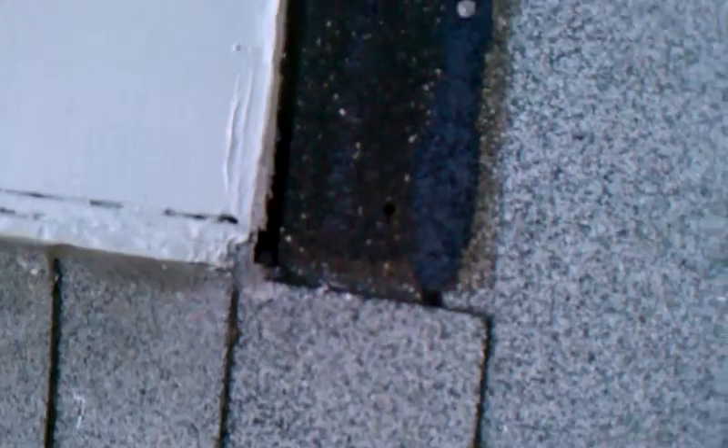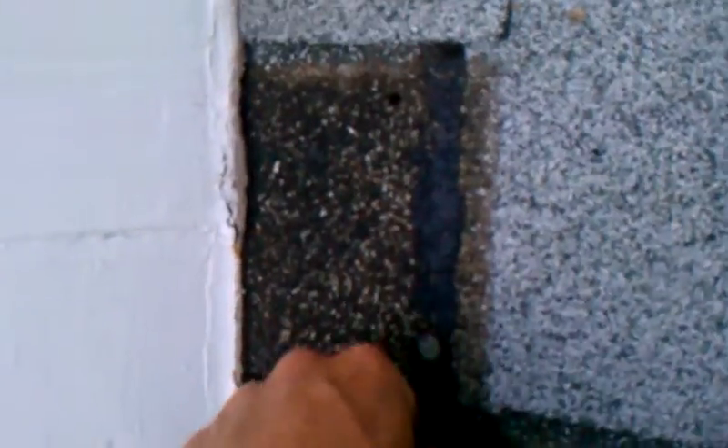In this case, I'm pretty sure it's going to be coming in around this corner because they have no flashing on it, and it's only caulked. What they did was they just went over a cedar shake roof on this particular roof, and if you look, there's not even any metal underneath — I don't see any metal underneath the second roof either. It's probably all under that wood shake, so it's like two layers of shingles over wood shake.